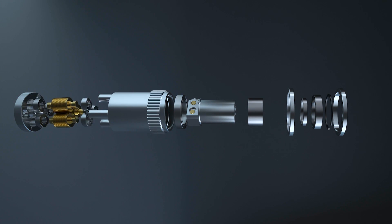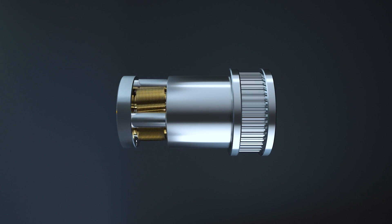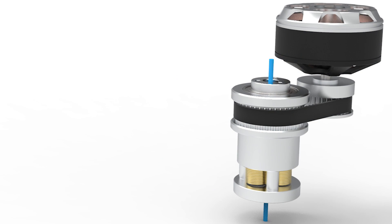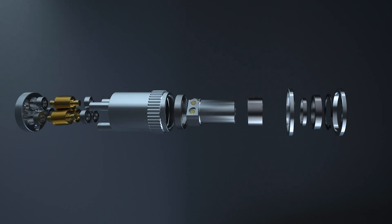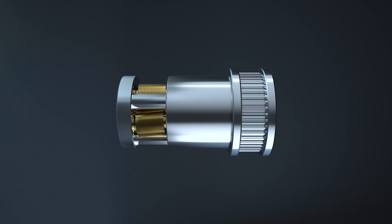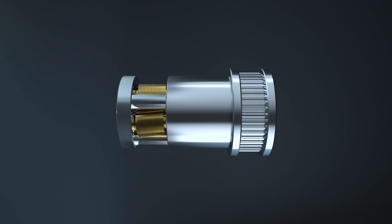Looking at the animation, you might notice how much rotational speed of the carrier is required to achieve any decent filament speed. The problem is that NEMA 17 stepper motors don't do well at high speed — the faster you spin them the lower the torque. To overcome this, Fuselab are using a brushless DC motor, the same type used in hobby FPV drones, which can spin exceptionally fast. However, these motors can't index position, so a rotary encoder is added to allow the control board to understand the amount of rotation, the speed, and what position in the rotation it's at.